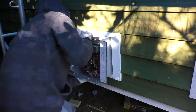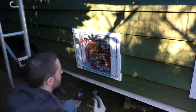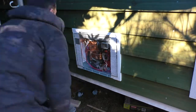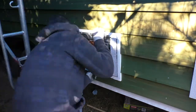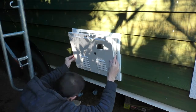The water heater in particular seemed like a bad place for water to be able to collect because it could easily then run back into the house itself. For the water heater, I cut some 2x4 scraps into pieces that would be the right size to give the water heater something to cleanly attach to, while setting it off from the front of the finished siding. I didn't leave much of the trim exposed since it wasn't really necessary and I didn't want to draw attention to the ugly necessities of the house.